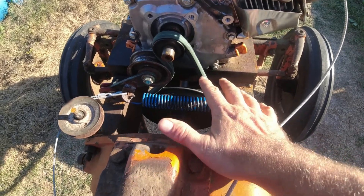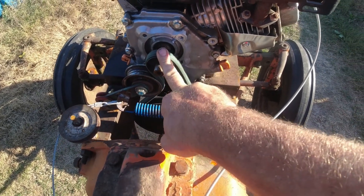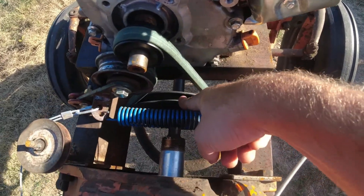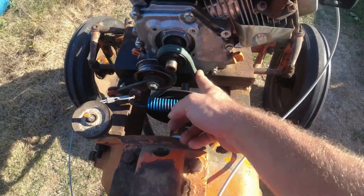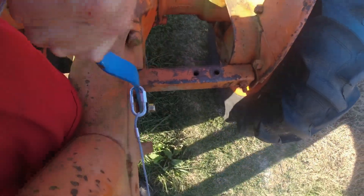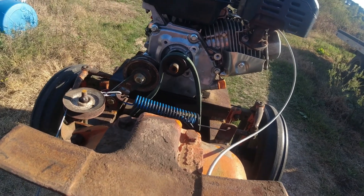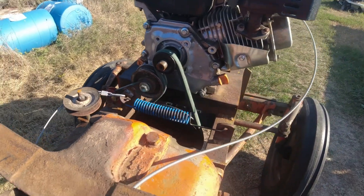This is pretty well just like the F20. We've got an idler pulley here, and this is a 2-inch pulley on top, this is an 8-inch pulley on bottom. B-belt, running 5-8ths. And I just got this set up — super simple hand clutch. When I pull it back, you can see it take the tension off the belt, and it pulls down.